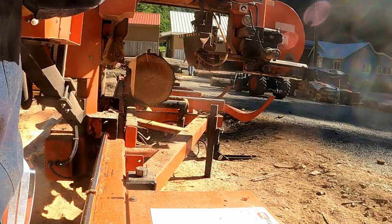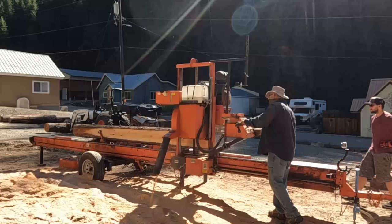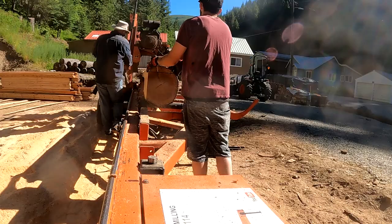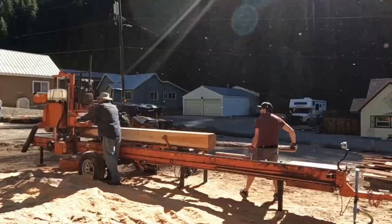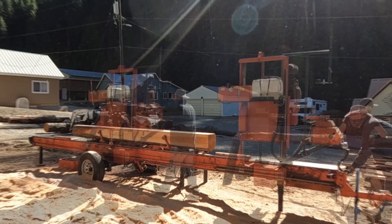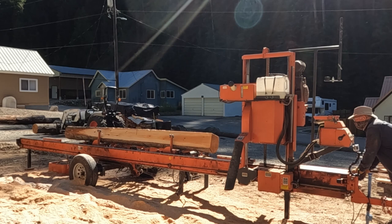But ideally, you're going to put that check horizontal to the deck and keep it in one board when at all possible. If you don't, that check will expand as the lumber dries. And of course, you're either going to have to stabilize it or cut it off. So in this case, I talked a little bit with the customer about it. Explained where the stress was that I could see.